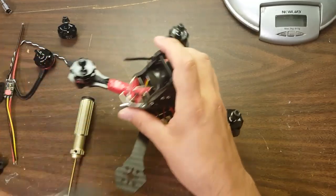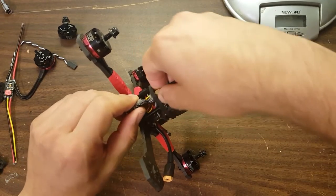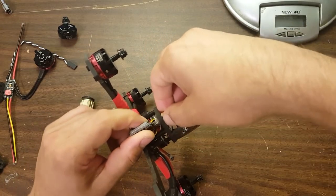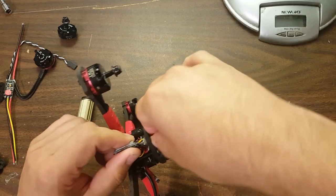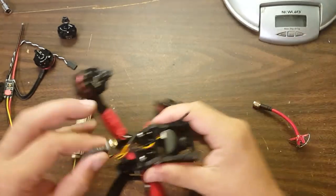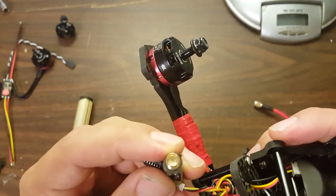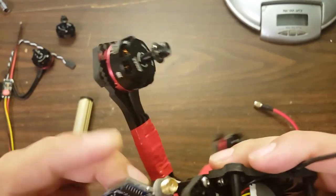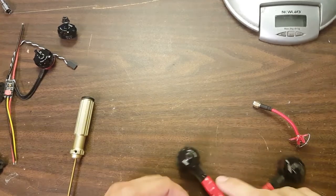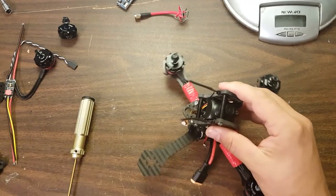The reason I'm doing it is to keep the antenna from wiggling side to side and getting into the props. I've taken some silicone tape — this is one great use for silicone tape I've found — to create little grommets like this, to help pressure-seal the joint so it's not going anywhere and won't wiggle. I was very careful not to damage the threads, but it was a little tighter than I could go finger-tight, so I used pliers a little bit. But that's not good and you shouldn't do it.